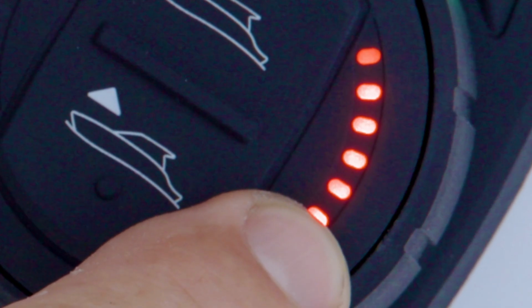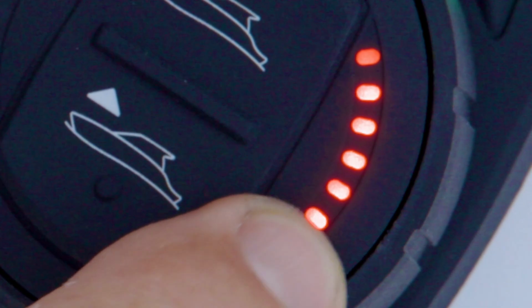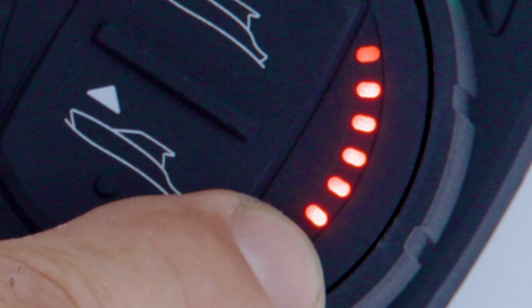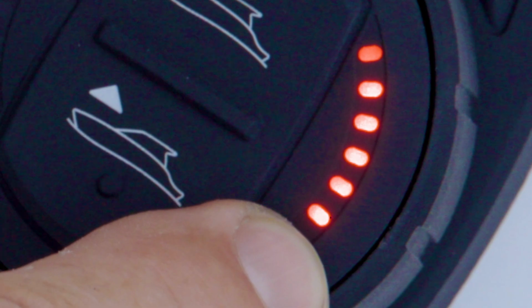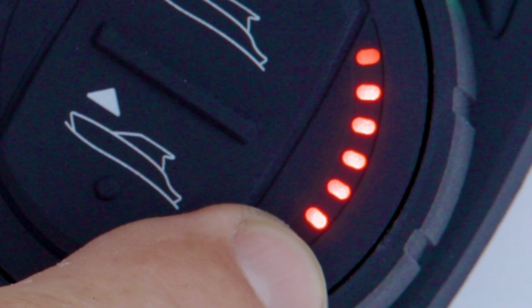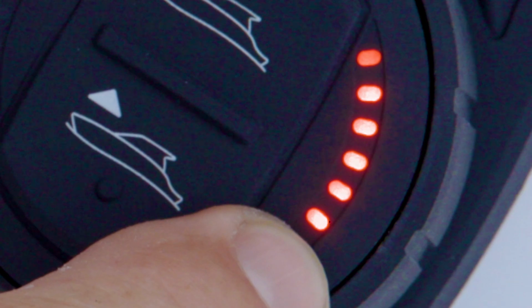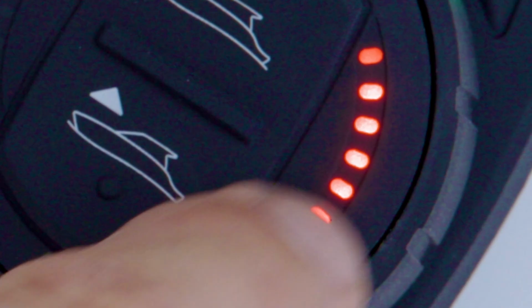The fifth and sixth LEDs indicate attitude and attitude rate data, respectively, and are required for ProControl Auto to function. Attitude data comes from the ProControl IMU. Upon initial configuration, the fifth and sixth LED may be flashing as data initializes. Wait until the LEDs are lit solid before proceeding.